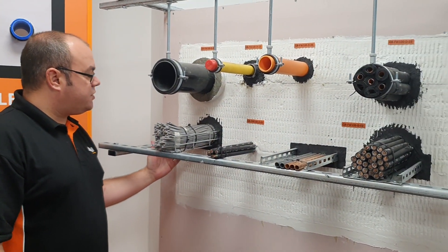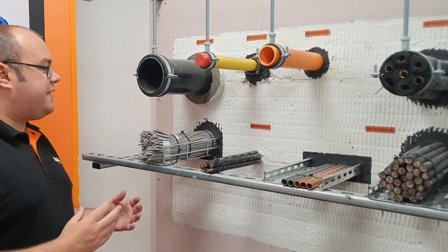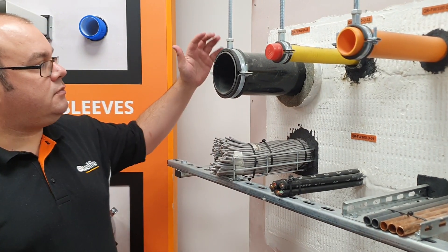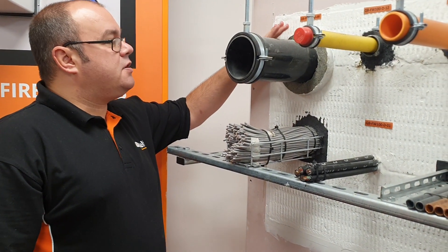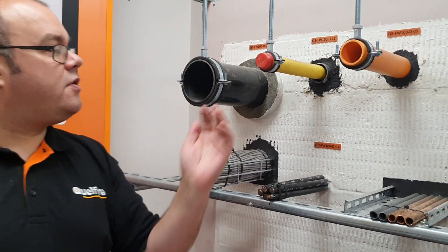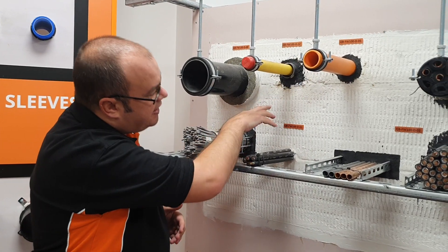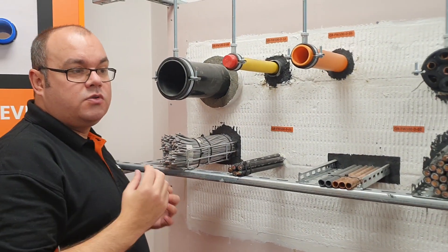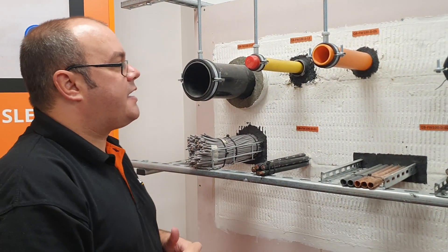On this wall we're just going to showcase a letterbox application. This time it's in a double skinned plasterboard wall — typically two layers of plasterboard both sides of the stud, around 100mm or thicker walls. Some of the details here: we've got a plastic pipe using our QIF fire sleeve, which is a sleeve with intumescent embedded into it that goes around the pipe through the wall. Just to the right we've got another detail using track pipe with our HPE sealant, and notably there's no sealant on this side of the wall — with gas pipes you'd only have a cold smoke seal one side, so the other side is free to let any gas leaks come out and be detected.